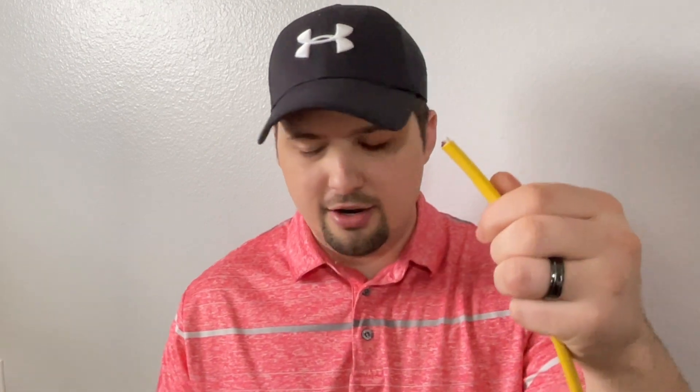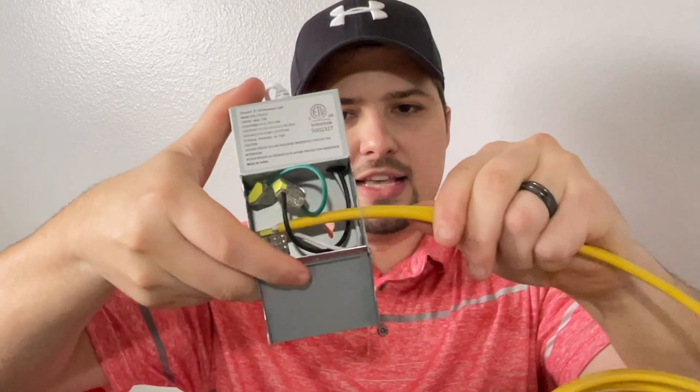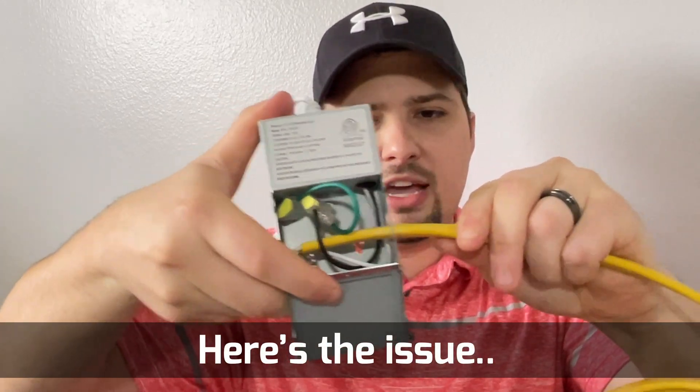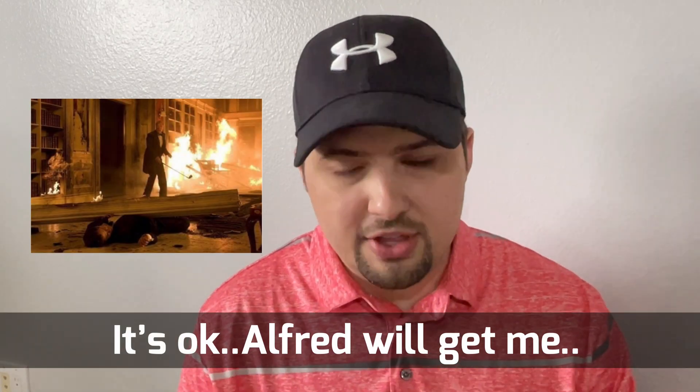You would take your wire and push it through this punched-out hole. You could then strip the wire and push it into the push connections. The concern that people keep commenting about is that this wire, in its plastic sleeve, as it goes into the box — I'm rubbing it back and forth on the edge — even though your wire shouldn't be moving, it could. Over time, that could peel back the insulation and cause an electrical hazard: you touching a live wire, or ultimately creating an arc that burns your house down.